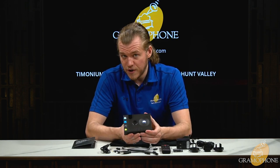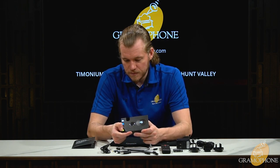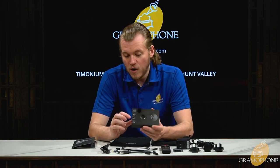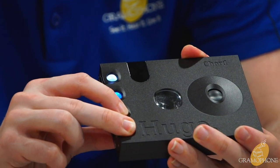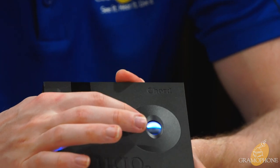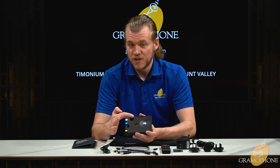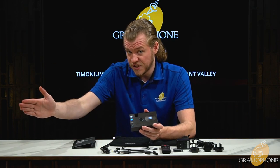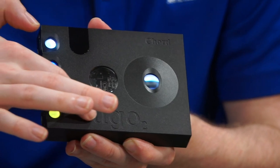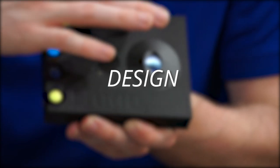An important note: since this is designed to serve both as a portable headphone product and as a desktop DAC, you want to make sure it's at the right setting. If you power it off and then power it back on while holding the crossfeed button, it changes to an indigo color — that's three-volt line level. Whenever you use this in desktop mode, do that so you have perfect output and don't have any volume issues downstream. Use your preamp for volume control in that case.